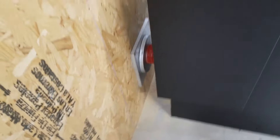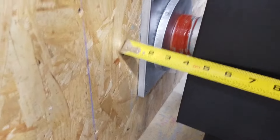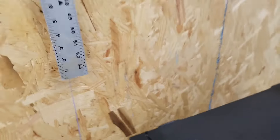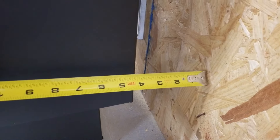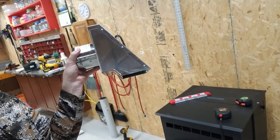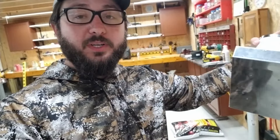Now that I'm through the wall, I consulted the instructions and I need at least a three-inch clearance in the back, so I went ahead and just did it at four. We're four on top, and I know I'm in there pretty square because I'm also four on this side. Now on the outside, I will put this weather cap on the end to make sure that rain can't get into the pipe and work its way back inside. I also purposefully gave it a little bit of pitch downward on the outside just to make sure there's no moisture migration back up into the stove itself.